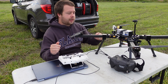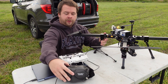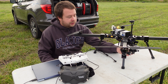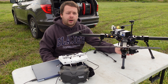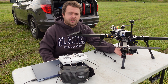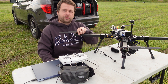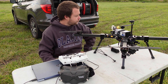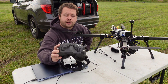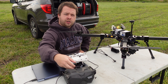All right guys, there we have it — got successful test flights and I'm pretty shocked actually. Usually I run into issues but not today. Initial thoughts: it's pretty cool. It's a little rowdy on the corners — you can see it was hot-rodding it, banking around super fast — but it does that in return home as well. Must just be stock settings, maybe more oriented for smaller quads. This guy's big and lazy so it seems like it freaks out going into those corners. We'll analyze the footage. I wish the OSD would display into the goggles — this is the new DJI OSD MSP enabled, with the hack on it from FPVWTF.